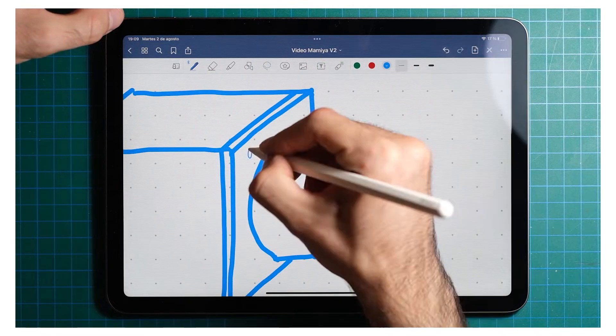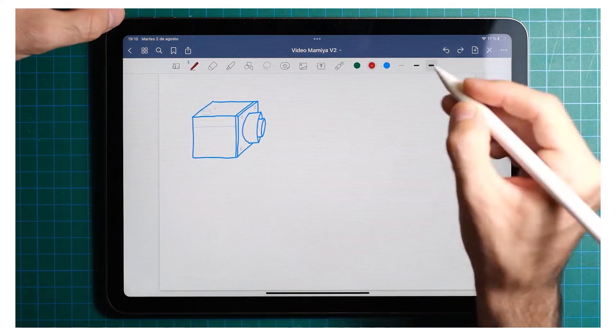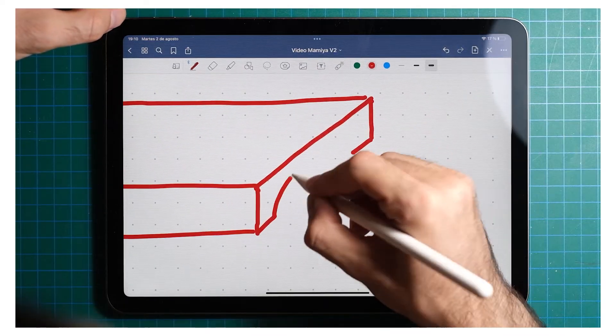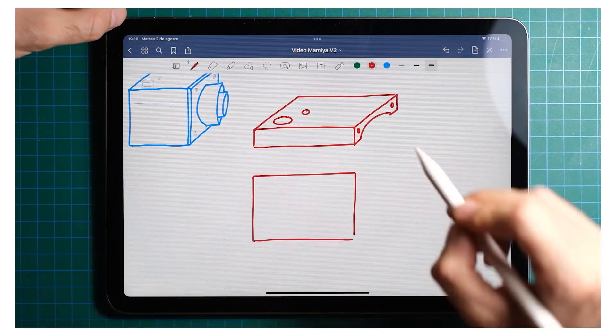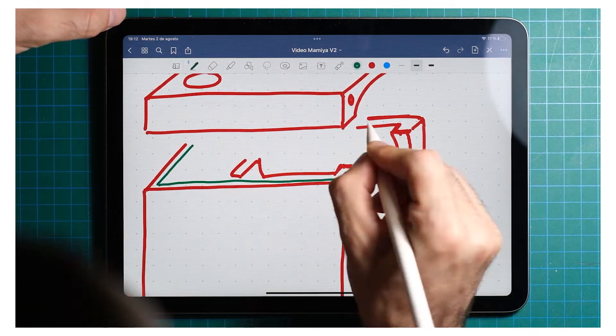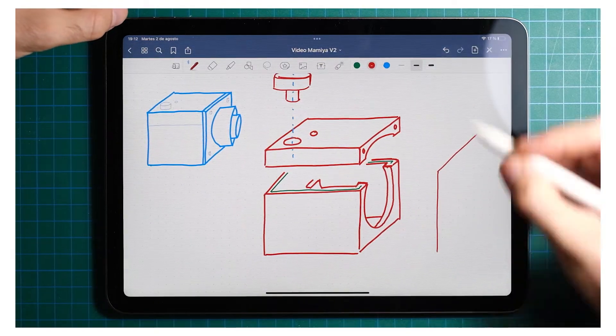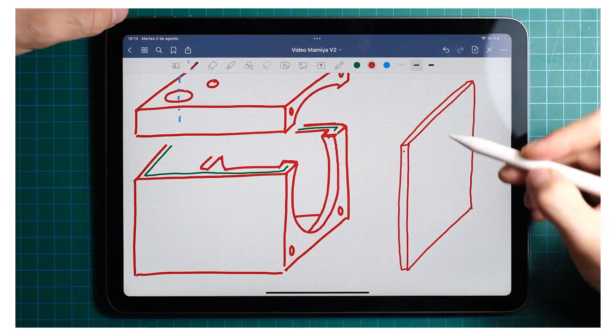Since I like the aesthetics of the first version, I'll be keeping the square look. The camera is basically a light-proof box that holds the lens on film at the correct distance. It must have a mechanism that allows the photographer to advance the film. Frames of different shapes will bring joy to the shooting process. The main parts will be joined using M5 screws and threaded inserts.